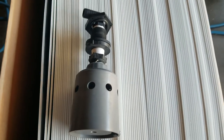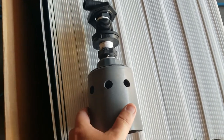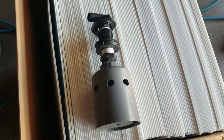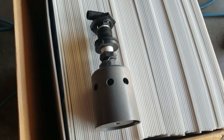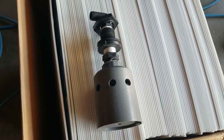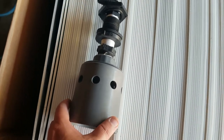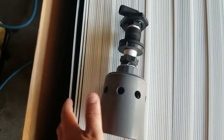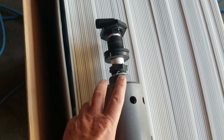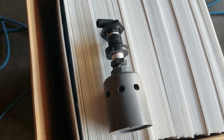This keeps water from coming in from your spigot and keeps your tank from overflowing. If you have a pressure washer where you're not using a buffer tank, you don't need this. But if you're using a buffer tank, most likely you're gonna have enough pauses, starts, and stops in your washing that eventually your water is gonna catch up. Most of the time — probably 99% of the time — they're using their customer's water. Even if the tank's full when you pull up to the house, first thing you're gonna do is hook up their supply line. This keeps it from overflowing, wasting water, and making a big mess. That's why you need one if you're running a buffer tank.